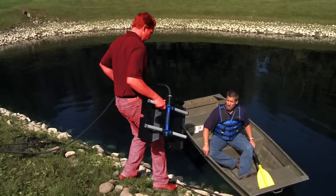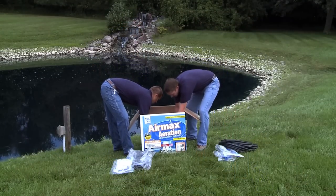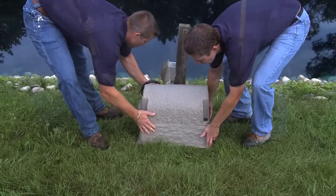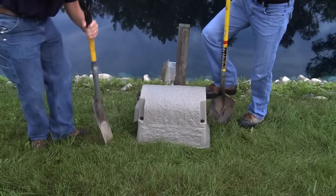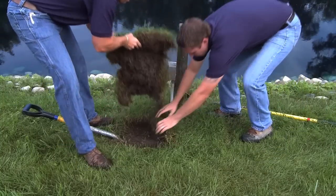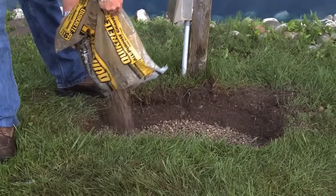You are now ready to place your cabinet. Simply place the cabinet on the ground where you've chosen to install it, trace an area about six inches wider than the cabinet on all four sides, then remove the sod or loose dirt. Fill in with fine stone or gravel — this provides a solid base for the cabinet and allows for proper drainage.